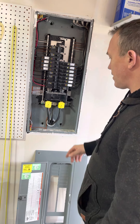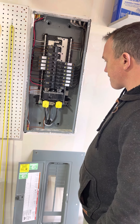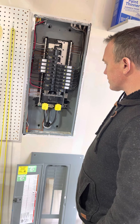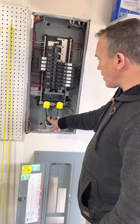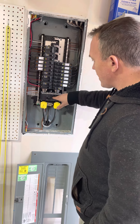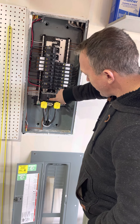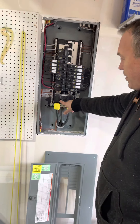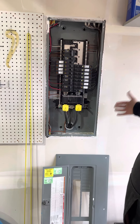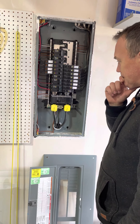This is a modern panel, so tell us a little bit about how modern panels are set up versus older panels. This newer one has lots of space in here. It comes in on a 200-amp breaker — you can read how much service you have by the rating on the main breaker. If you had two panels that both had these, it would be a 400-amp service.